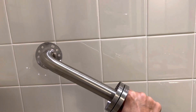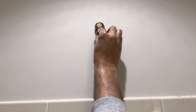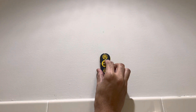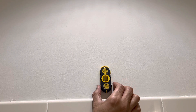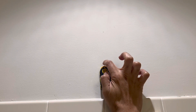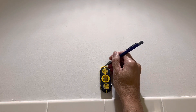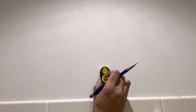The first step is to find where the studs are, and then the rest of the installation will proceed. I use this magnetic stud finder — just by rubbing it on the wall, wherever there is a screw or nail it will react. As you can see, there is a nail here indicating that the stud is right here.